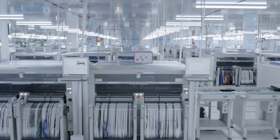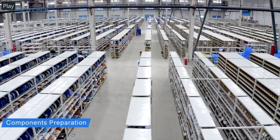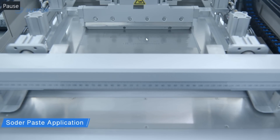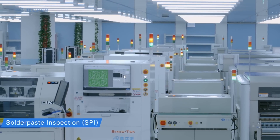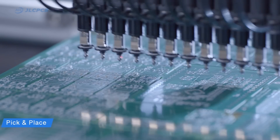This week's podcast is brought to you by JLC PCB. I want to show their factory tour. They have a giant warehouse of component preparation where each shelf is numbered and corresponds to your order, so that when your order is ready everything gets scanned in along with your PCBs and stencils. When you have a PCB assembly made, a stencil is required because everything for surface mount components is done through machinery. The machinery goes through and spreads solder paste only on the areas of the PCB that require components, then it gets scanned to make sure nothing splattered and everything lines up.